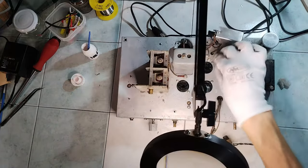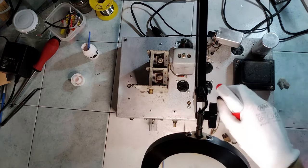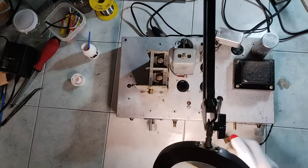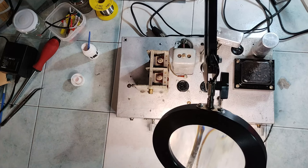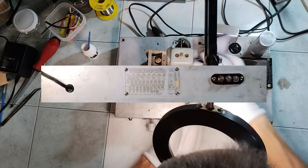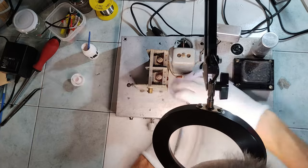In the process, alcohol was used to wash from the residues of the other products to avoid inducing corrosion sometime later. Unfortunately, the products used against rust are also very aggressive. When the phosphoric acid was used, a drop must have touched the license plate on the back of the chassis, erasing some of the writing.